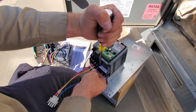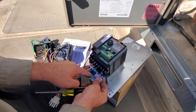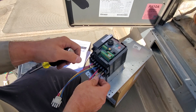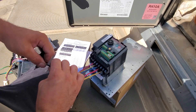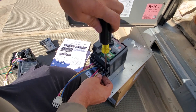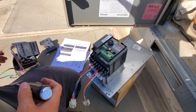I like to torque them down and then back it out and then go back in - you'll get a good tightening out of it. Make sure to leave that label down there so I remember the motor goes there. I'm going to be careful too because you can break these terminals. Nice and tight there - I've got to do my ground wire.